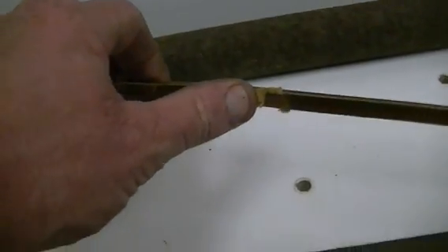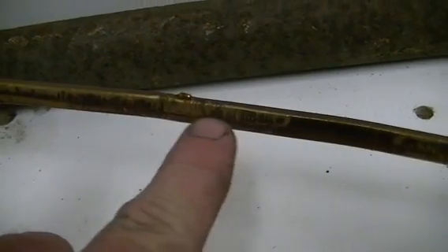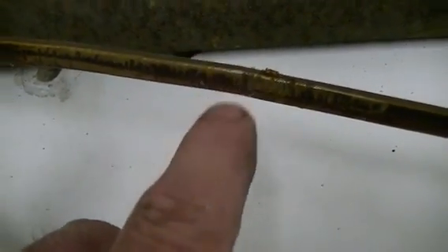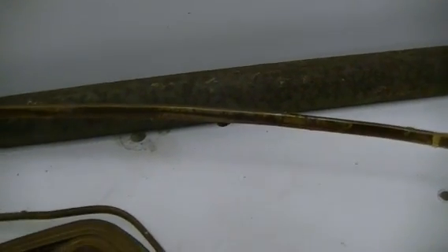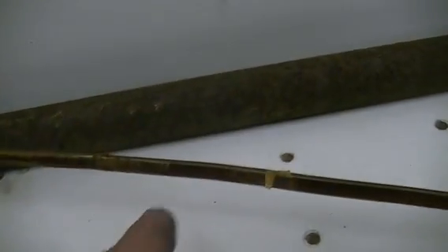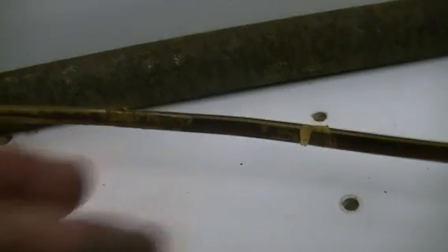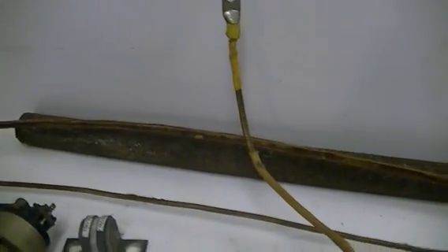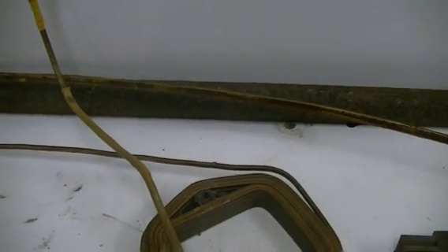The pot core will be wound in air core fashion. Being aluminium, it is very easy to straighten out. The darker colour you see on the wire is the varnish or lacquer applied after winding, and there is also a lighter colour lacquer which is what the aluminium wire starts with as insulation. It is very robust — I've cut a piece off and twisted it backwards and forwards many times and the lacquer does not come off, so hopefully we won't have any shorts when we rewind it.